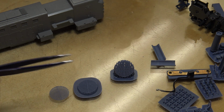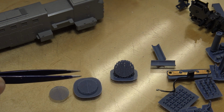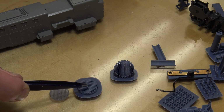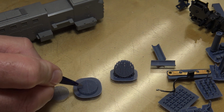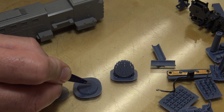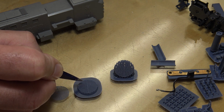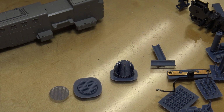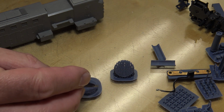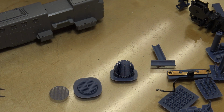When they come out of the printer, they're kind of wavy and don't look really good, but as soon as you cure them, they tighten up and straighten out. These are 6/1000 wires, so I made the thickness of these bars 0.006, and the thickness from top to bottom is 20/1000. The ring around it is 6/1000, but that wasn't holding this together really well, so I bumped it up to 10/1000, and a few thousandths makes a big difference.